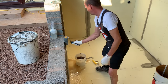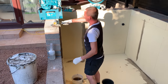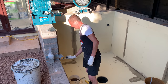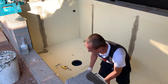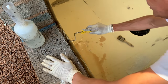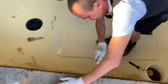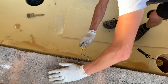Just going in round the window frame, which Matt kindly made, measured for us, got it exactly how we wanted it. Giving us a 7.5mm overlap each side, time the thickness of the fiberglass goes on and sets. Reckoned roughly around about 5mm each side, innit, Matt? Yeah. Now Matt's just rolling it all out. You're going to have a go at any minute? I will be. So you can get a feeling for the sensation of it. I just said to Matt a minute ago though, this smell now is 10 times worse than what it was a minute ago. Been rolled out now.